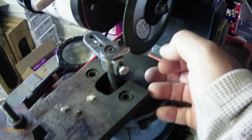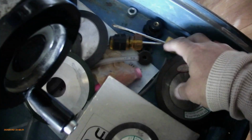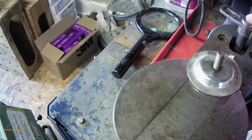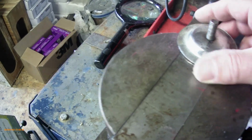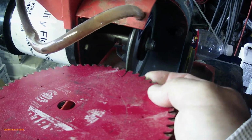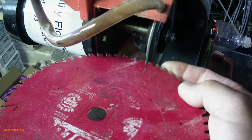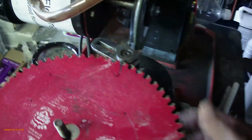Anyways, for all those who have something similar, for me the trick is, there's a little cup that fits over the blade in the back. Anyways, I don't have anything out here. Oh, here it is. So this little cup you tighten down over the blade, but when the blade's sitting out here against this, it doesn't do a really good job. So it still has vibration once you connect the blade into that. By the time you get that engaged, since these aren't that precise, the blade can just really quickly chatter back and forth, and so you don't get a really good surface.